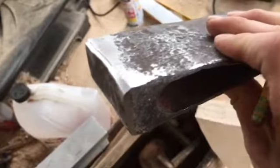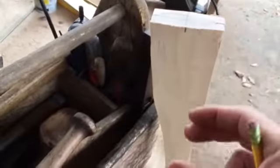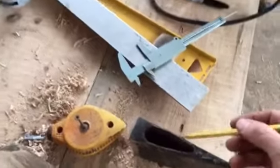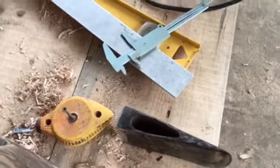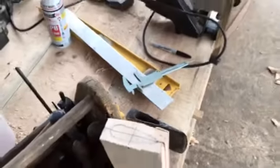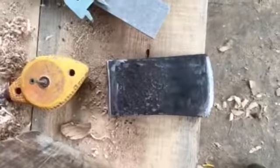I've slightly egged the bottom of the eye hole so that it fits into a cone down onto the head, and it doesn't give you that curl where the sharp edge of the eye cuts into the handle. I've relieved this just a little bit. Also pay attention to your heads so you don't get them upside down.